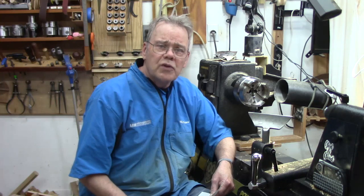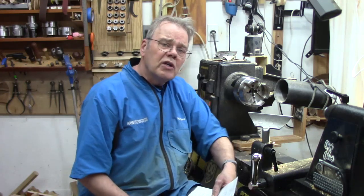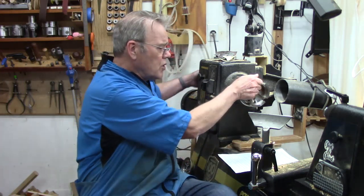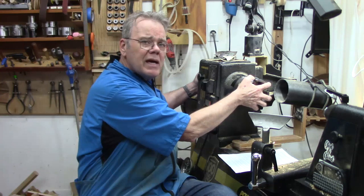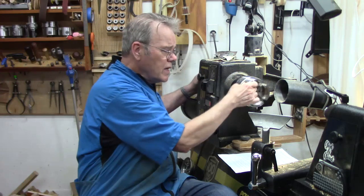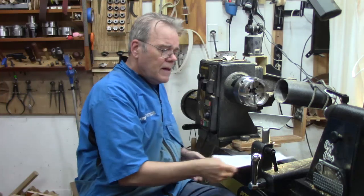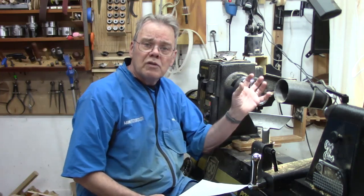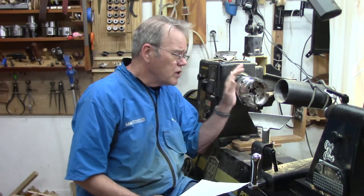However, I have had a chuck unravel when I shut off the lathe abruptly. Here's what's occurring: it's turning this way and then all of a sudden the spindle stops, and you've got this big mass of metal — maybe with a large unbalanced project on it — and it has a tendency to act like a big flywheel. That can be rather disconcerting. I've not had that be much of an issue with a smaller chuck — it's only happened with the bigger chuck.